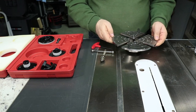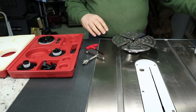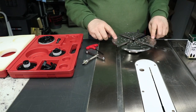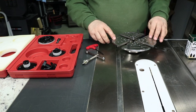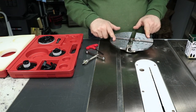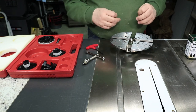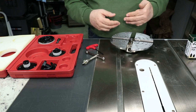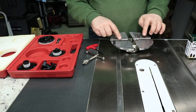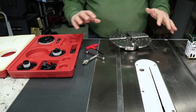Looking at accessories, there are lathe chuck flat jaws available online. I already had some from a previous lathe chuck that work perfectly - these are the same thing as what PSI has online, probably for less money. Mine gives a maximum diameter of about 7.5 inches; the PSI one online gets a maximum of about 8 inches. My lathe has a 10-inch clearance maximum, so 8 inches is well within tolerance. These are numbered for the four plate positions and have a key stop to prevent the plates from coming too far apart.